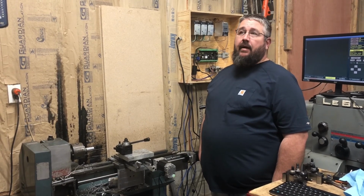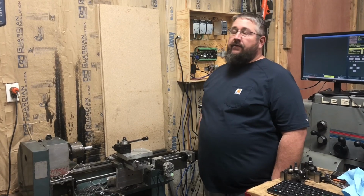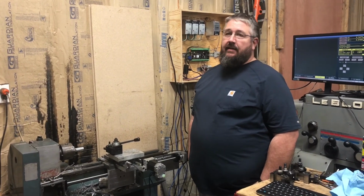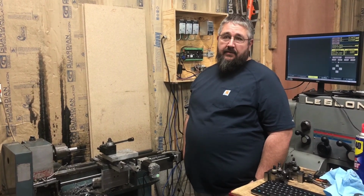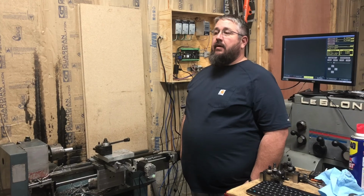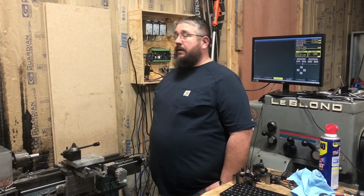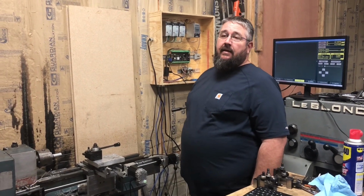Today Brian's been back at it. He started at 7:30 this morning. We finally got it to where we can do tool changes. We finally got all the offsets set. We ended up zeroing parts off the chuck as a constant. It's a whole new world compared to the mill. You can see our Masso, we've even got the cover still off the face of it.